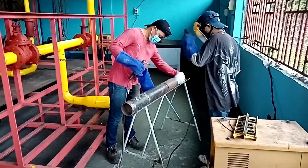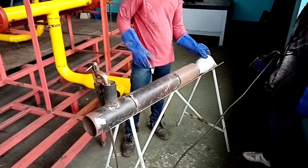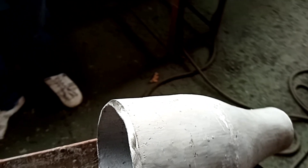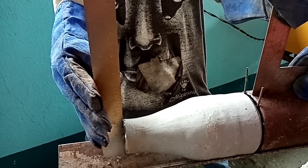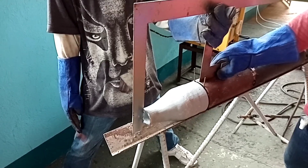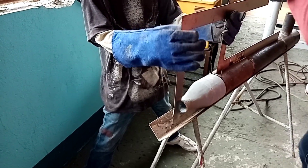The next pipe installation is the fit-up of the concentric pipe with the reducer of 2x4, with the bevel area of 37.5 degrees. Connect the pipe, then tuck and weld the top area. This is the concentric pipe. That is leveled. Then tuck and weld at the upper portion of the gap area.